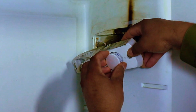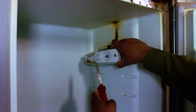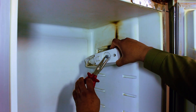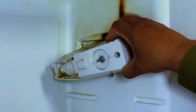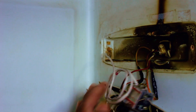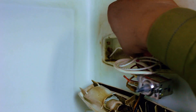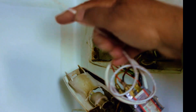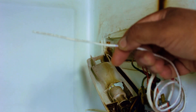At this point, we'll detach the control knob — simply pull it straight out toward yourself to release it from the shaft. You can use a proper nut driver for this, but I'm going to use needle nose pliers to loosen and open the nut. The manufacturer has provided this specific hole for the thermostat's capillary tube to pass through. Only about 4 to 5 inches of the capillary tube goes into this hole, and I have already marked the tube at that specific length to ensure it's inserted correctly.